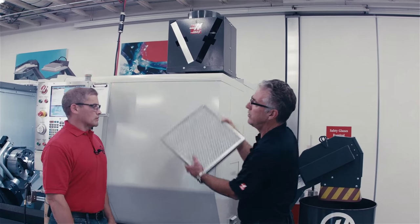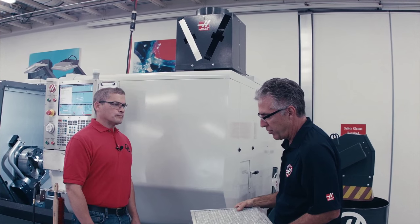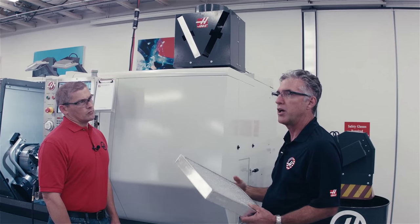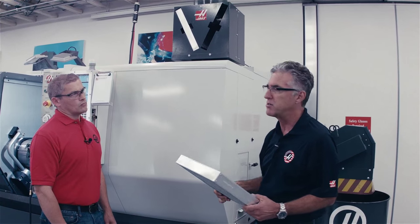So how often do I need to clean those filters? Well, that depends on the material that you're cutting. If you're cutting billet or aluminum, not very often at all. We've run them for months and months in our own shop without having any kind of maintenance on them. But if you were to cut a material that has some particulate associated with it, say cast iron, then the particulate — the dust — would collect on the surface and they would require more frequent cleaning.